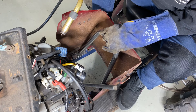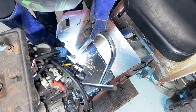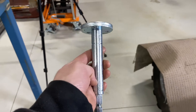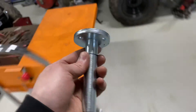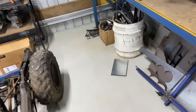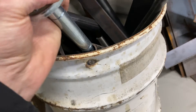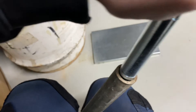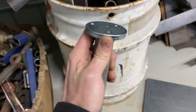It's a bit tricky because we've got nothing here to measure off, so we're going to use the old eyeball method. We've got this little adapter and we need to make some type of bearing for it. I was going to buy a pillow block for about 30 bucks but let's have a rummage through the old steel bucket. Found a bit of old galvanized pipe - that's perfect! We'll cut a section, put a grease nipple in it so we can grease this thing up.